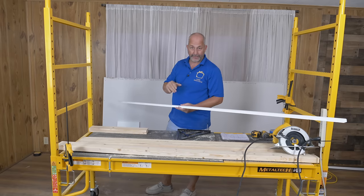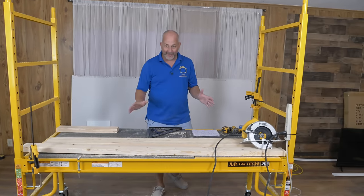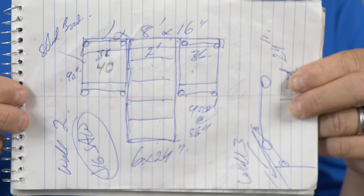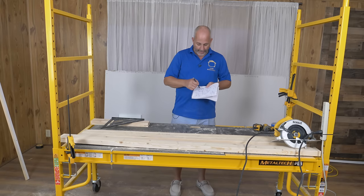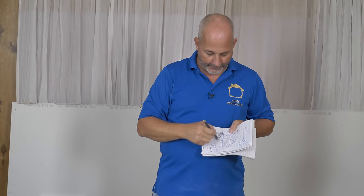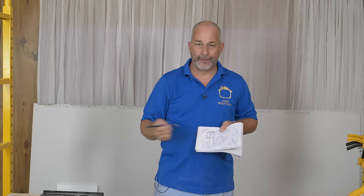I can use my chop saw to cut the cleats into the finished box. Building the boxes I'm doing freehand because I don't have all the tools and I'm not in the mood to buy any today. Here's my design — I wrote this out on basically a napkin, it's not that tricky. Box number one is going to be 40 inches tall. The concept is simple: a square box with a piece of French cleat on it and a shelf on the very bottom. I'm mounting this close to 7 feet on the ceiling so we have 36 inches of space, then 36 inches of space, with room before the floor — you can get twice as much closet space on a wall.